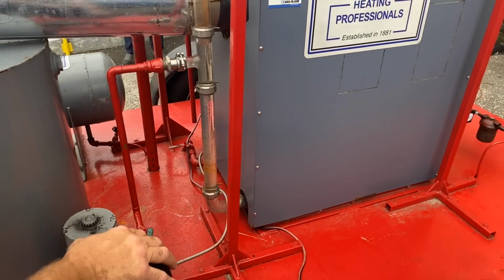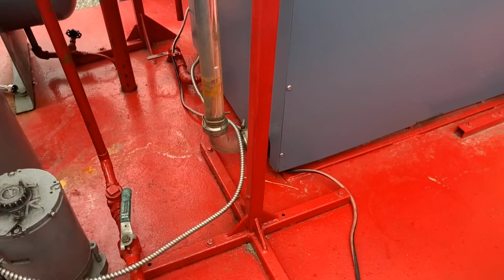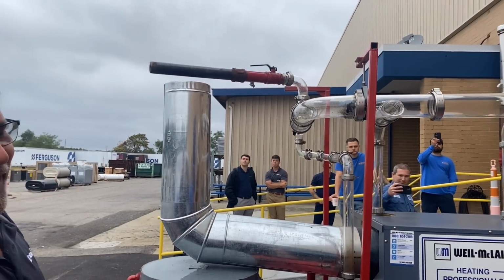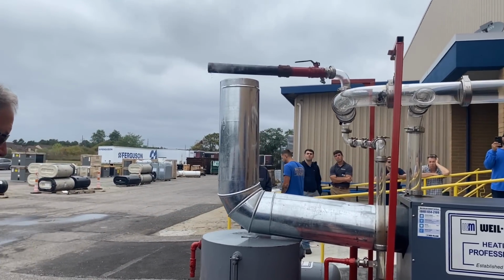Well, now it's going to do its own thing because it's starting to come back up. But very briefly there, you saw that the flow was going in. Now it's shut off. The pump shut off. But if I had the pump full open, it's pulling the bubbles down into the boiler. If I have it cocked, the bubbles just kind of hang out there in equilibrium.